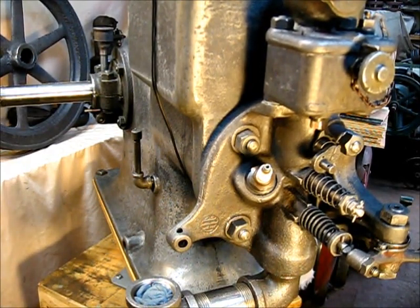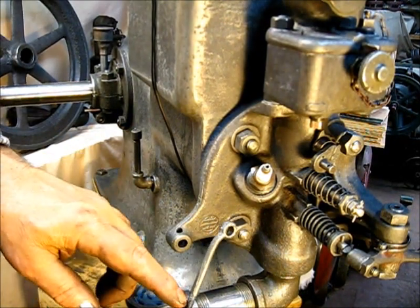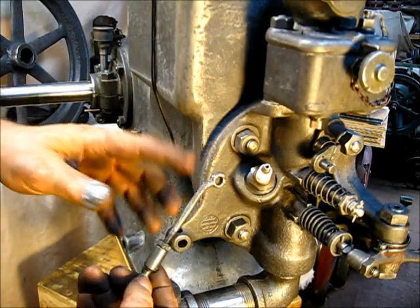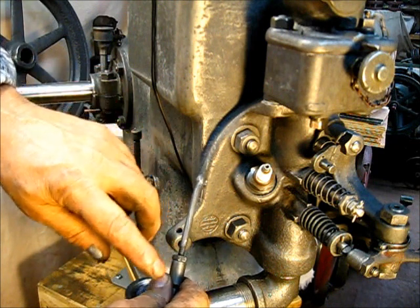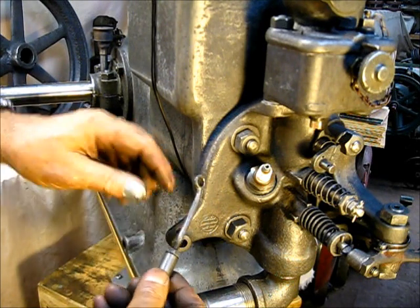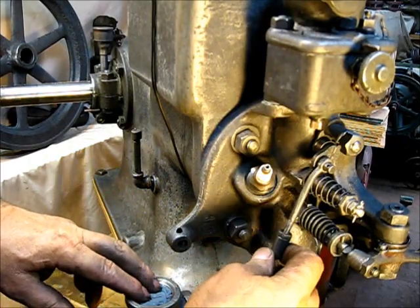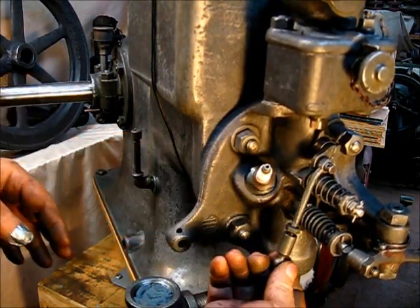It's this little thing right here. This little arm right here — this part — was forged. It was put in a press, a piece of metal placed in there, and a die came down and forged it. You can see the parting line; normally it would have been straight down halfway from one end to the other. On this one it comes down and then twists a quarter of the way around on both sides — someone has tightened this in the past so tight that they twisted it. You never know what you're going to find — these engines talk to you. Let's just put this on here; we've got plenty of play and good free threads.